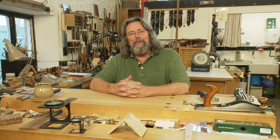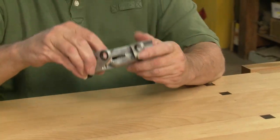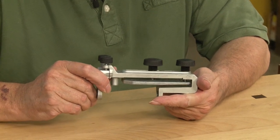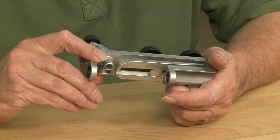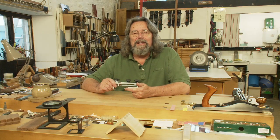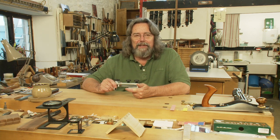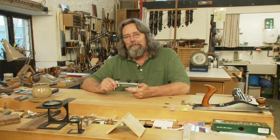Hello, welcome to my workshop in North Devon. I am particularly pleased about this new Tormek jig which is the SE77, and you may wonder why. The reason is that it gives me an accurate and repeatable method of grinding the sort of cambers that I need on my bench planes.